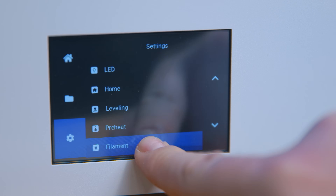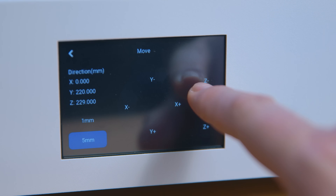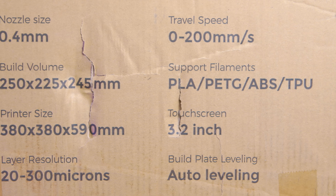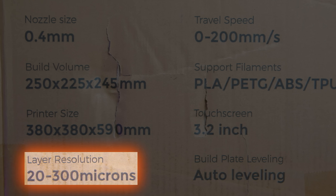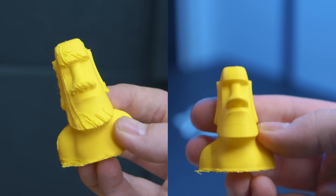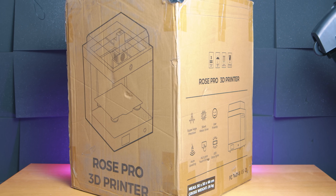This is just what the printer is. It isn't a bad printer — for somebody wanting to just print stuff and not care, it works, and the interface is really simple. But it feels like this is made to be '3D printing in girlfriend mode,' and the marketing team didn't get the memo. I've also pretty much had it proven to me that 20 microns is not going to give us smooth prints — the difference between 0.02 and 0.06 millimeters is so small that you really don't want to spend 600% longer printing to achieve a 10% better surface finish.